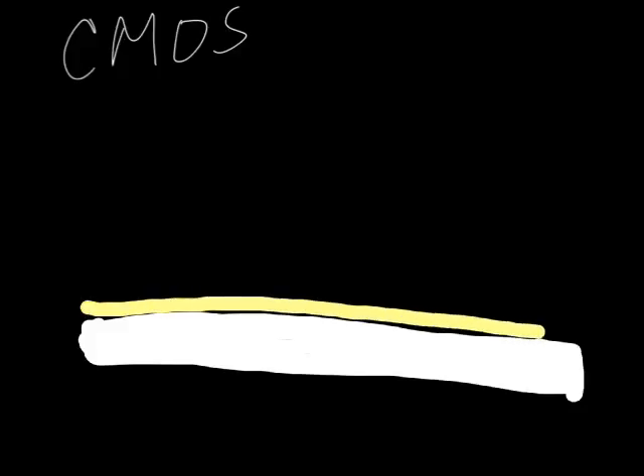It's a layering process. So maybe the first layer we put in could be something like silicon nitride. The crystalline stuff might be 600 microns thick. The silicon nitride might only be one micron thick or half a micron thick. So I'm not drawing this to scale — it's a schematic, a way of showing something to get you the idea of what's going on.